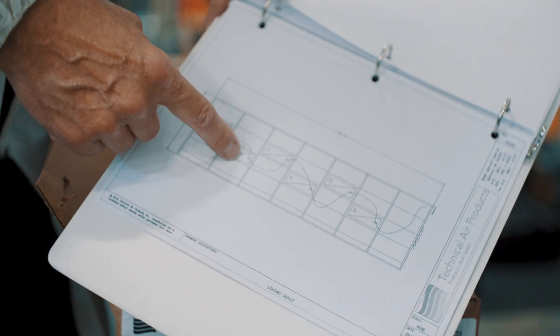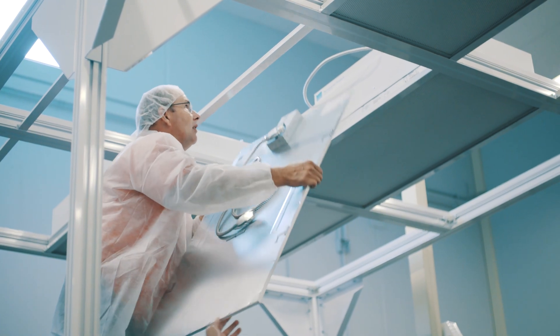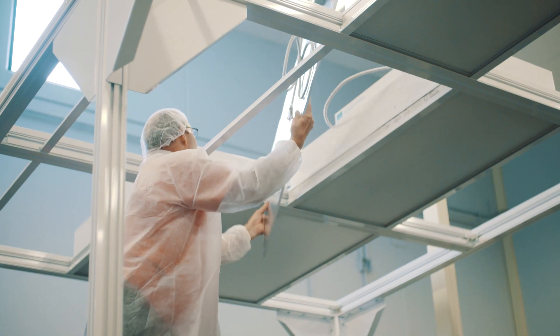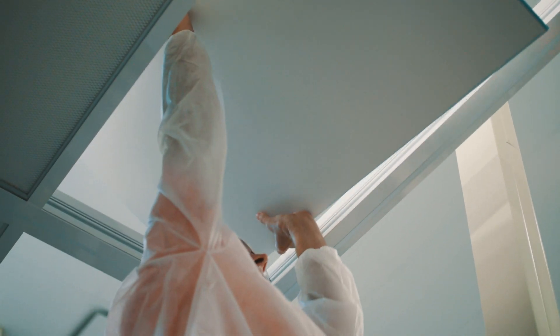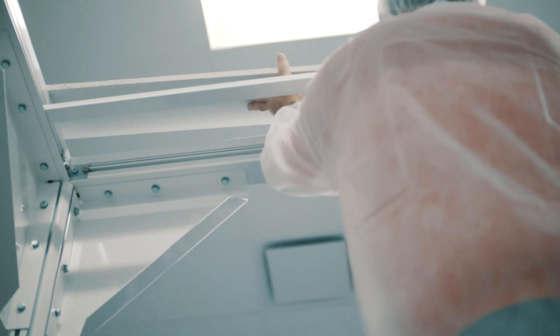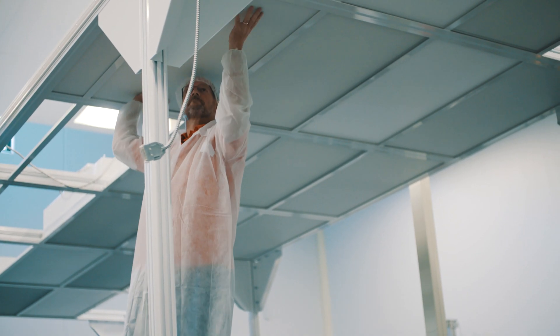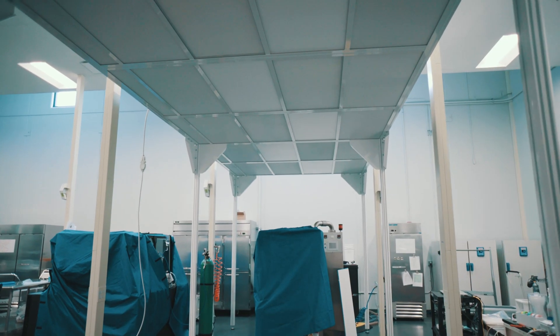The HEPAs and lights go up, and the electrical components — basically a ratchet-lock that snaps together — get attached. Once those are in place, put up the ceiling tile. Once the full ceiling system is done, attach the vinyl curtain to the exterior. After the unit is set up and electrical is hooked, run a test. Make sure the pre-filter — which comes with the HEPA units and has an arrow indicating airflow direction — is installed with the arrow facing down before turning the unit on.